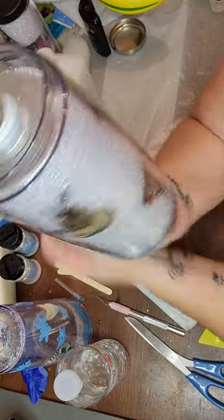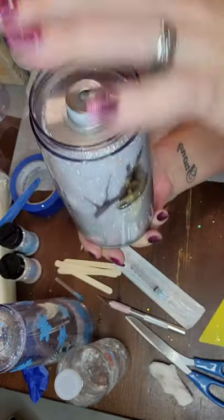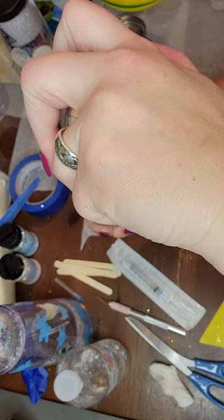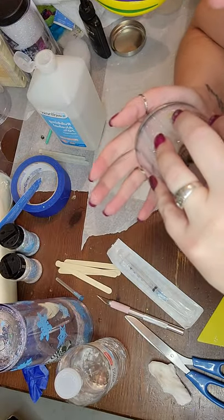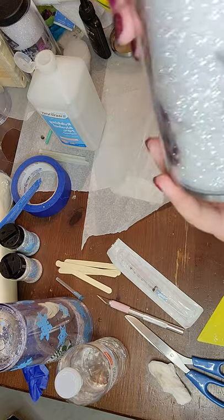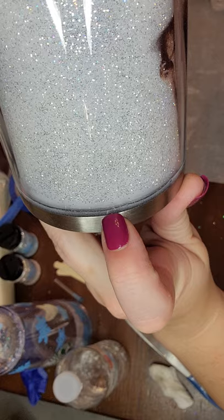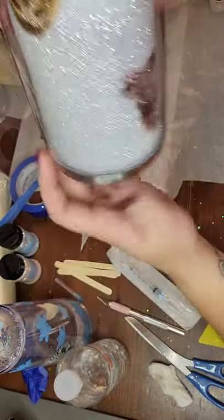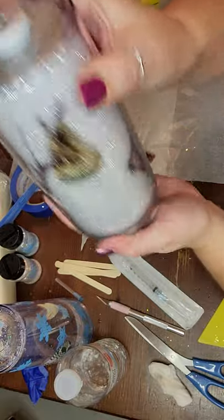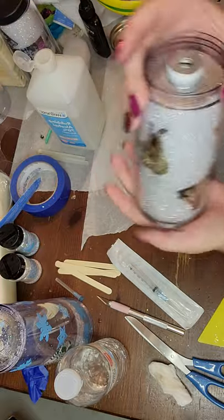With the Fast Set it's generally dry within about four or five hours — I leave mine overnight. Now that I've got the outside clean, I'm going to give it a little twist to make sure it is completely on there, then push with both hands to make sure I have a nice seal. The reason I add so much epoxy is because then I can see it — I can see where it is right above the stainless steel. I want to make sure it's all the way around the cup and I have a fantastic seal on it.